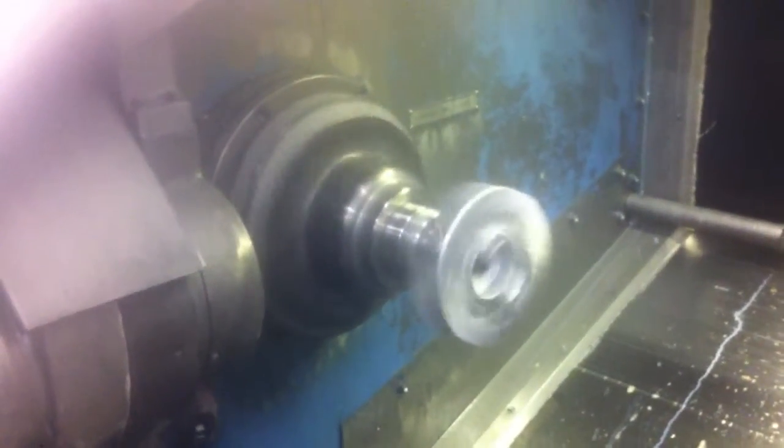Okay, then what we're gonna do is turn the spindle on. Now I want to put an indicator on — I can see it from here even though it's a different position. Look at your casting — it's not totally true and straight. But what I want to do to prove it, since I don't have a program in for this yet, I'm gonna touch off this part with a tool.